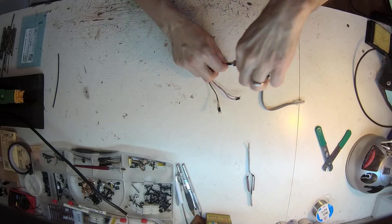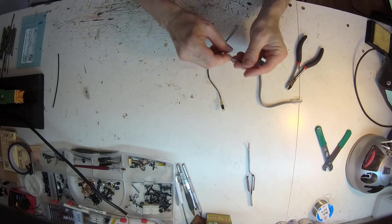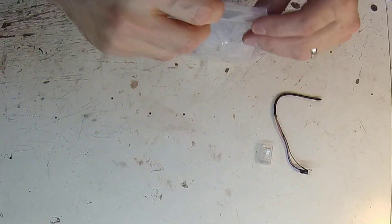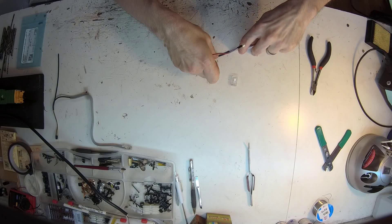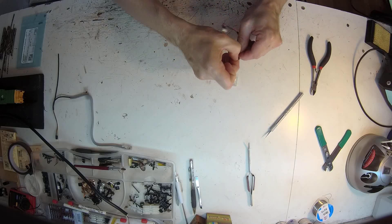And of course there is. For starters, we can cut off the wire that has the blue wire in the mix and repurpose it into another signal attachment cable. I picked up this bag of cat5 connectors for a few bucks on Amazon — probably enough for a lifetime. Now we just need to get the right pins in the right places. Luckily there are only four wires per cable, and it's the middle four that Atlas uses.